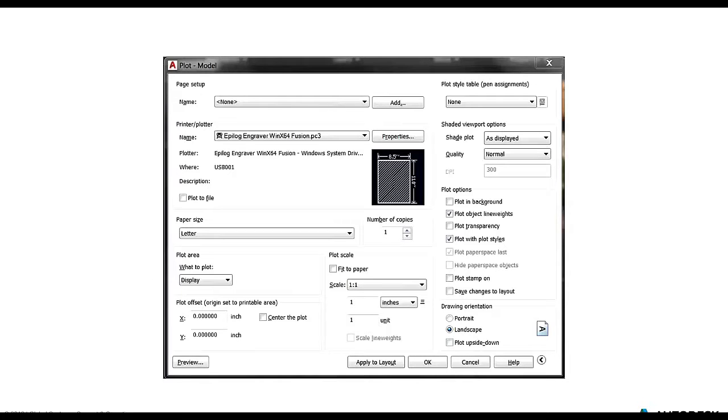we did some trial and error. We did notice that, with this Epilog printer, or cutter, sorry, the order of operations was actually quite critical. The Epilog was really good at throwing these little quirks at us and resetting the scale or the extents. So we found that it was really important to go through this order of operations where we first established the properties in the Epilog. And then under page size, we selected something reasonable to represent our print environment.